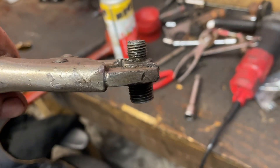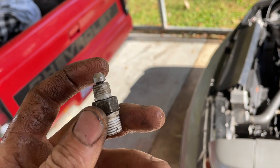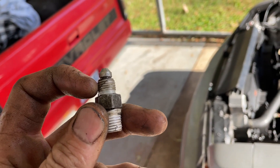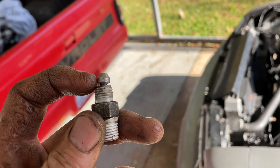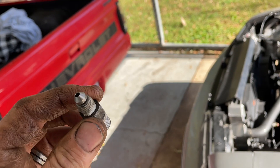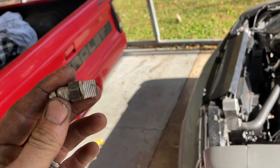Let me get this machined down a little bit. Now I got it ground down, so I'm going to take my hand file and level it. Make sure you Teflon this because this becomes your seal — if you don't Teflon it you've made a leak right here, it's gonna leak on those threads. Let me put it together and test it real quick.